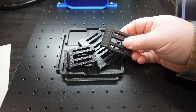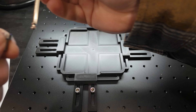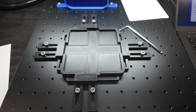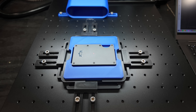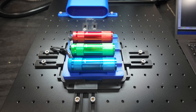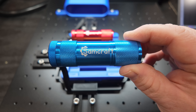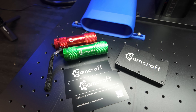First, what you're seeing me install is a jig base plate adapter — a product I develop and sell — which lets me use my jigs to get engraving on objects much quicker and easier for batch production and everyday use. The first easy materials are anodized aluminum, metal business cards, and a metal wallet. These are easy to engrave by most lasers; even cheap blue light diode lasers can handle them. Showing that a UV can do them checks that box, but it doesn't fall into the wow-factor spectrum of UV lasers.